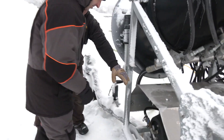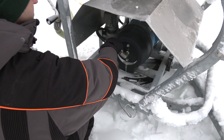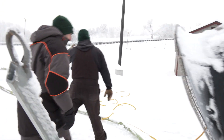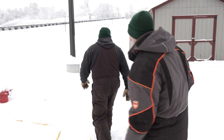So there's a valve right down here. Once you turn that on, you will be pushing air out the snow cannon. You can hear it coming out. We know the nukes are open and everything's operating as it should. So we'll go over and we will turn on the water from the pump house.